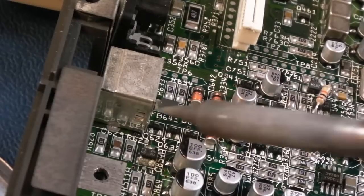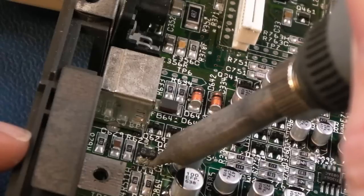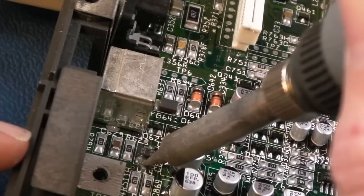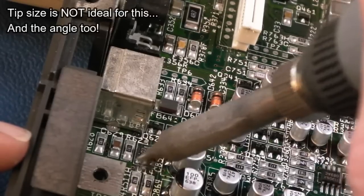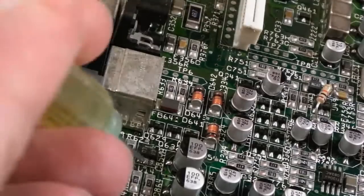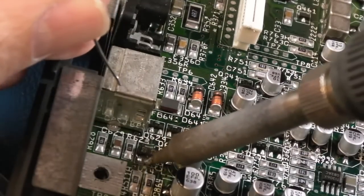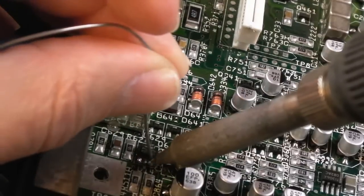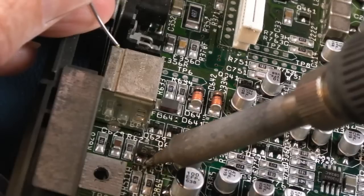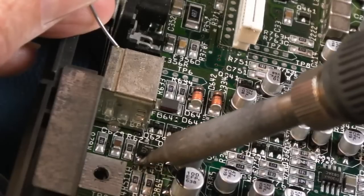Right, the cap has been soldered into position. It may go out of focus here. I'm just going to heat these and reflow them. Yeah, the solder is not flowing very well there. What I may need to do is use the braid here. Let's just try that actually. And I really should be using magnification for this. I'm just going to bridge them all at this distance, aren't I? Anyway, I'll report back in a minute when I've removed the bridges, reflowed it and cleaned up.